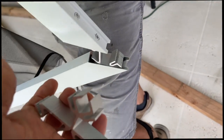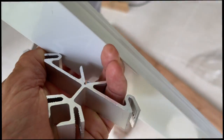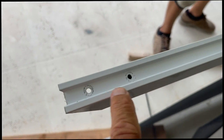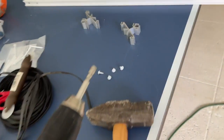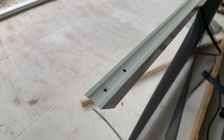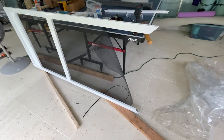Now we're ready to pull the top off. When we do, you're going to see there's a silver triangular piece that sets in there — the screws lock into it. We're going to keep the top as-is with the angle on it, but make sure you don't lose those two triangular pieces. We've got to shorten the frame from 80 inches down to about 77 and 3/4. Once that's done we'll put it all back together.